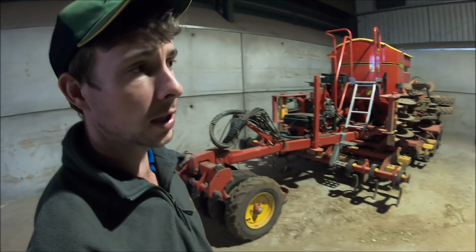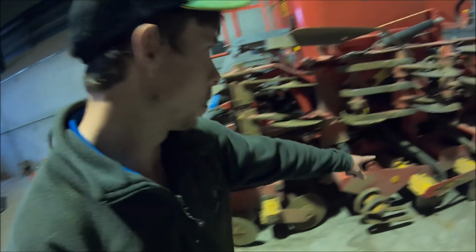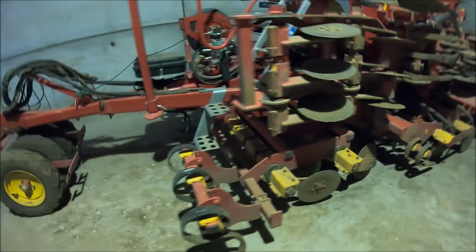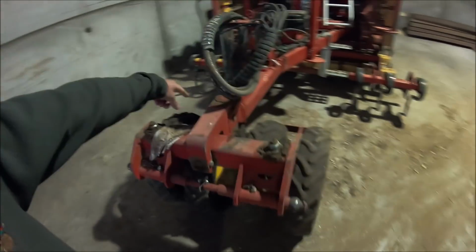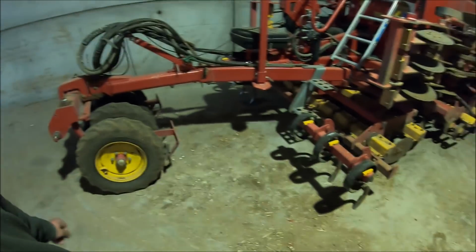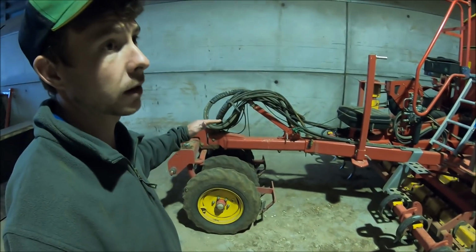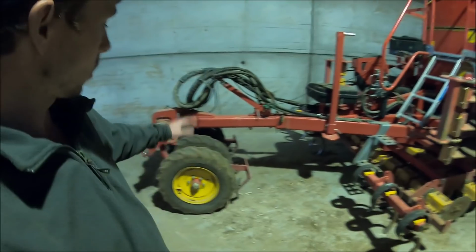So it is a minimum tillage drill, so it's got these front working discs, so you can work the seed bed before these discs and coulters then place the seed in the ground. A little bit stiff. So if we go back to the beginning, it's pulled by the lower link arms on the tractor with a pivoting headstock. Those wheels will run on the soil, so you get the right height on the front of the drill, and it means you can also lift the drill a bit to put more weight on the back of the tractor to get more grip, and vice versa. If you want to let weight off the back of the tractor, you can lower them down to do that.